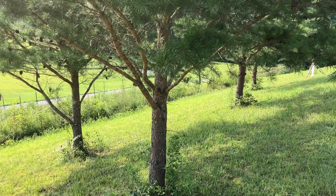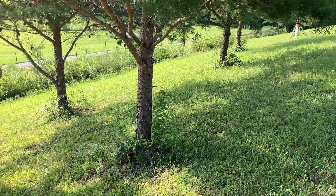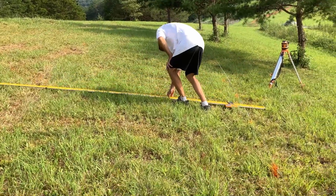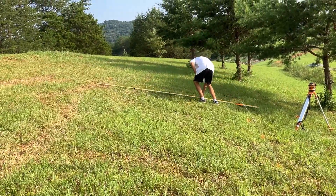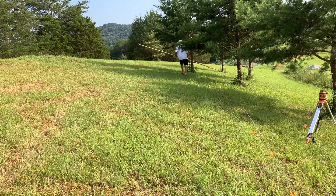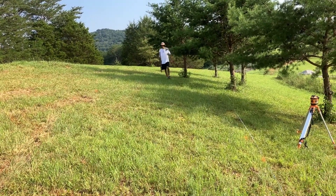As you can see, we do have a few trees here. These southern pine are kind of in our way, so we're going to be just cutting those down to make sure that they don't interfere with our leach field. We laid out the second row — you can see the orange marks — and now he's just measuring the distance between the two lines. There's a minimum of six feet, and with our gradient differences, we figured we'd shoot for 10 in the hopes that, as things get a little closer or farther based on the grade, we'll still have that six foot minimum.